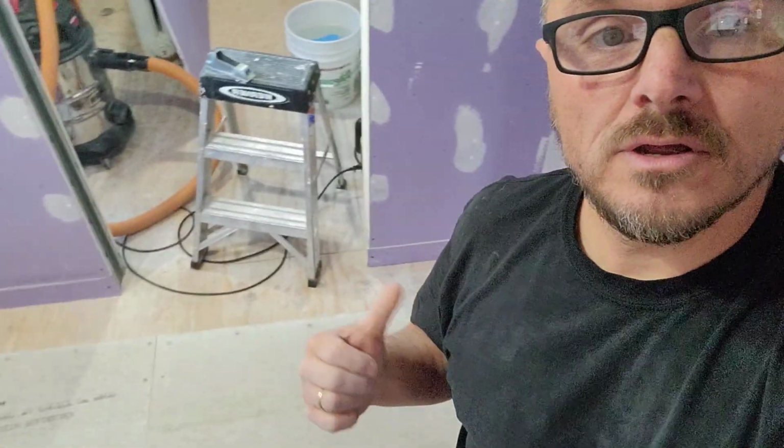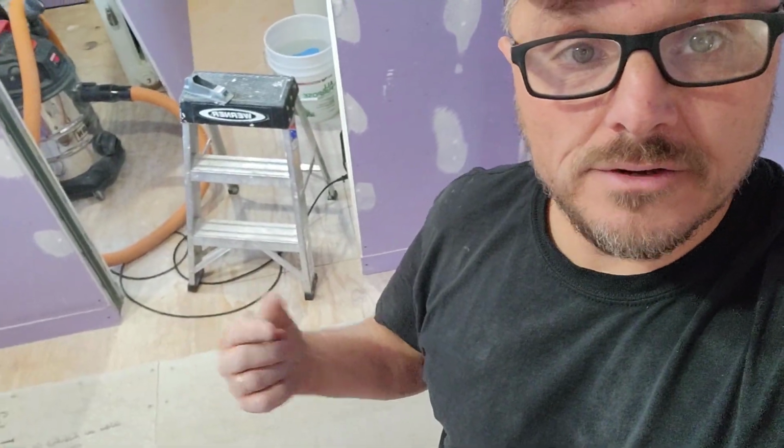So I'm down to two fillers. Filler. Filler. And then that room will be later. So it's measured, cut, fit, and then at that point I can go down and I can screw all of this in. After I get it screwed in, I have to hit all of the screw heads with basically a putty knife, make sure that the screws are actually set in, that they're countersunk, and that also scrapes off all of the debris, and then I'll do a quick vac.